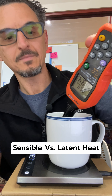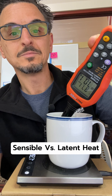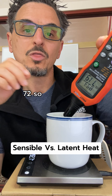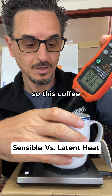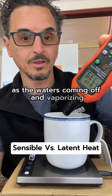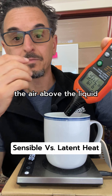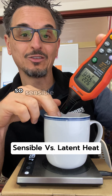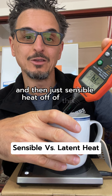It's at 68.7 — try not to get coffee on it. It looks like 70, 71, 72. The moisture it's reading in the air — that is latent heat. As the water comes off the coffee and vaporizes, it's adding moisture to the air. The air above the liquid has a moisture component which is adding humidity, and that would be latent heat. So you have both sensible and latent heat coming off the liquid, and just sensible heat off the cup itself.